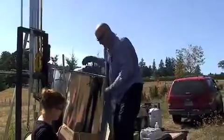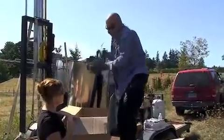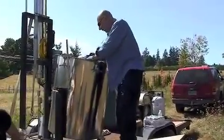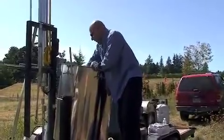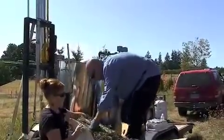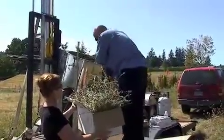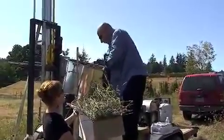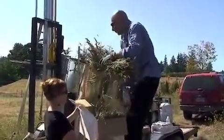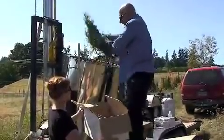Robert, can you tell us a little bit about distilling the stem and the flower in this particular plant? Well, the optimum would be to minimize the stems. The stems don't contribute much positive impact on the oil. There may be a bit more camphor in the stems, but this is what we've got to deal with — this is the way it was harvested. Stems take up a lot of unproductive room, and you have to heat up that unproductive material, so that takes energy. If you can minimize your stems, that's great.